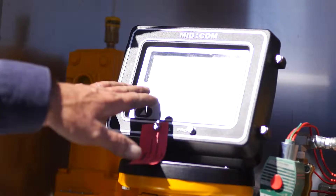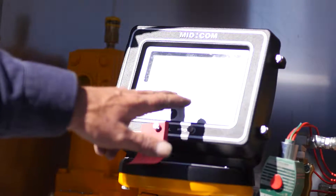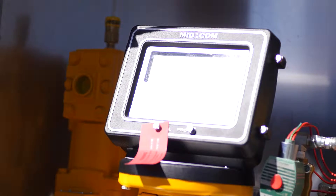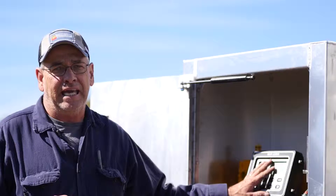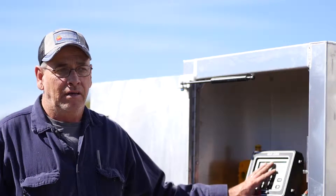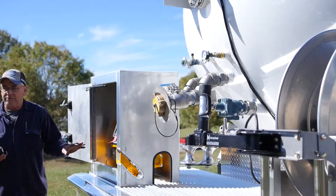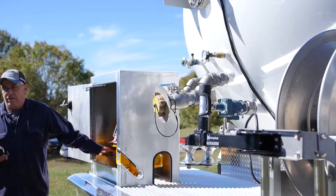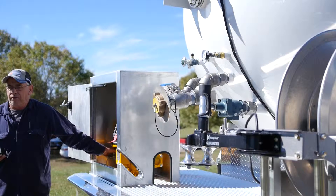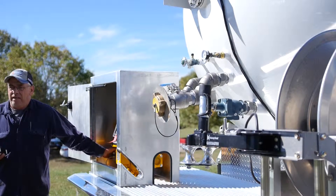You want to come back to the back of your truck. You always want to know how many gallons per minute your pump is pumping. Once your pump slows down and it's not pumping the gallons per minute it should, you need to cut off all of your valves going to your meter, bleed your meter down, remove your cap off of your air eliminator, pull your strainer out, clean it, and that should get you back up and going again.